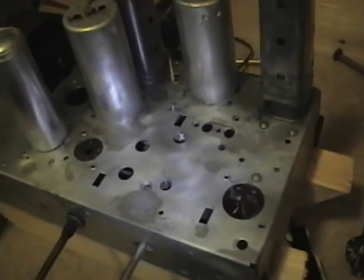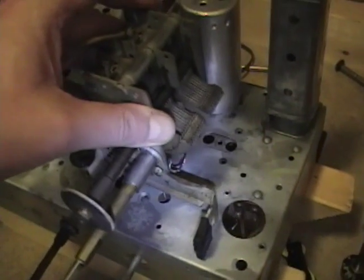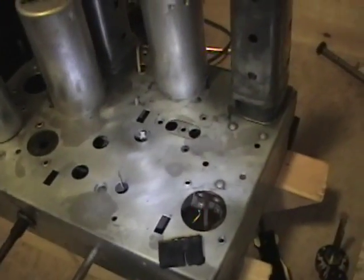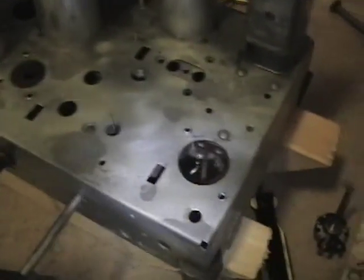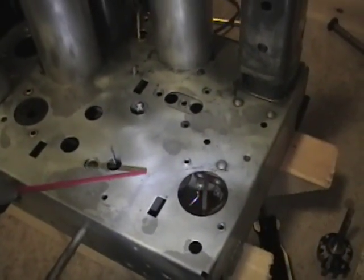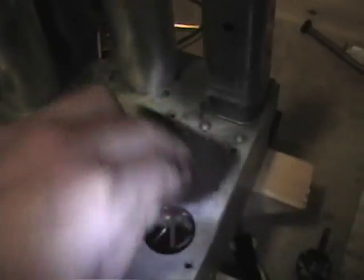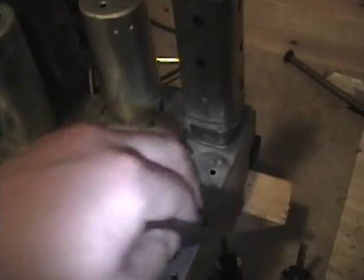Here's the chassis itself. I pretty much removed all the rust a few years ago, but when I did it initially I didn't remove the tuning capacitor. This time around I feel more comfortable working on these sets — more confidence I'll be able to put it back together properly — so I went ahead and took it off and removed the last few traces of rust. Once I do that, I like to take a little WD-40 and give it a spritz, then wipe it down with a non-conductive abrasive pad. I should say: apply the WD-40 to the pad first rather than shooting it directly under the chassis.